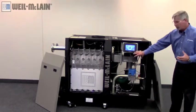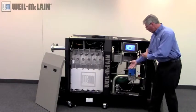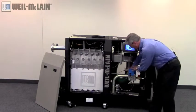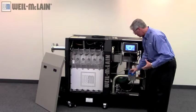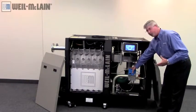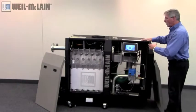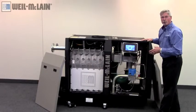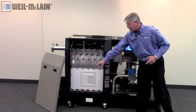Components inside — our Sola control. Look at the spacing: it's wide open and very easy to service. Your gas valve — you can get behind it and through it. You have your low and high gas pressure switches. We have our basic dual-seated gas valve, which can be tested through CSD1 controls and safety devices via the technology of the Sola control. Your gas train comes through the front of the boiler with your water supply and return lines.